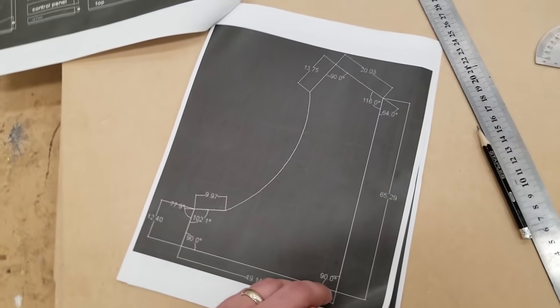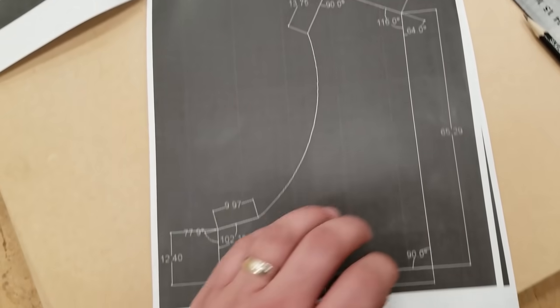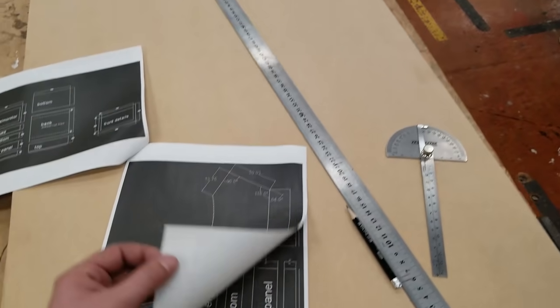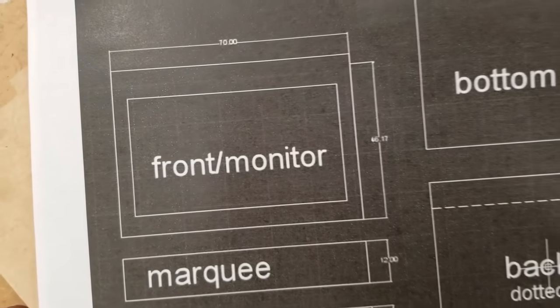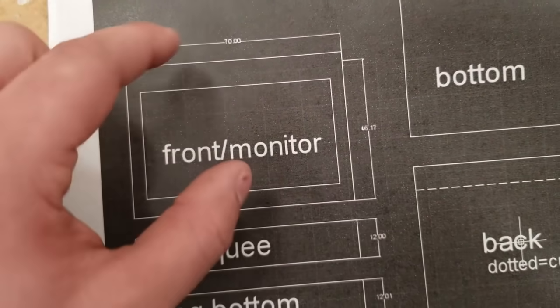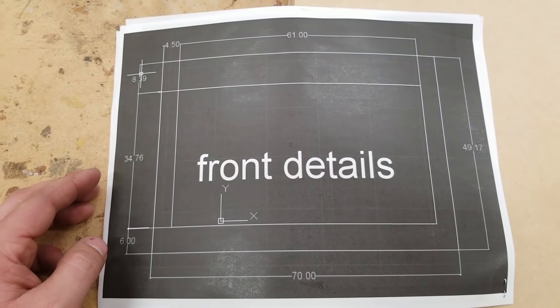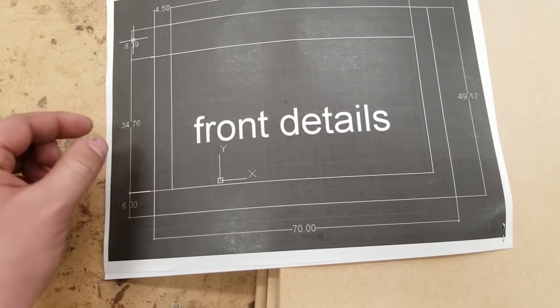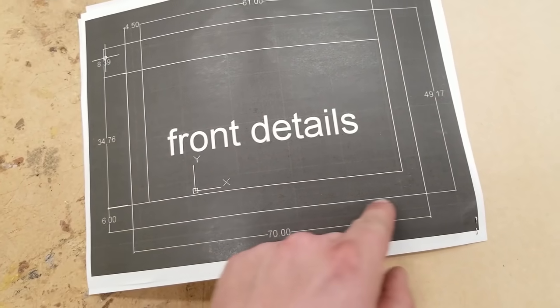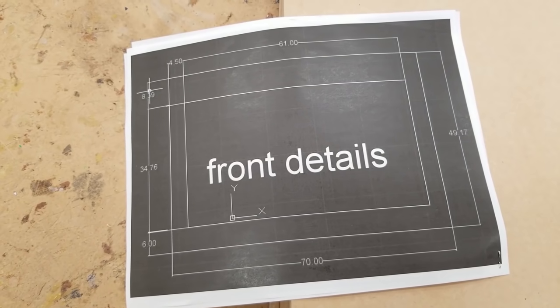Since I don't have a full-size printout, I wrote this up in AutoCAD and have added all the different angles that I'm going to need to do with my protractor, and I'm going to draw everything on. These pieces are pretty much the exact same as my other ones, but I've made some changes just to the actual dimensions, a couple here and there, and I will make those available with the link in the description. The screen is going to have an opening that's 61 by 34, and hiding behind it will be all the blocks that hold it in place. It's just a TV screen.